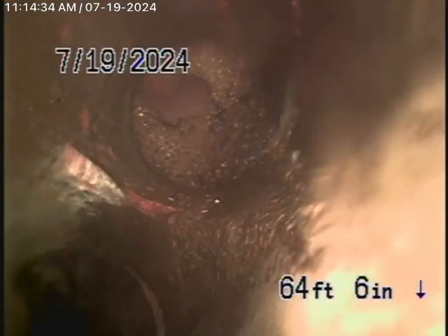Running the camera upstream, we've determined it goes all the way through to the next-door property — we're in at 64 feet, which takes us all the way there. Obviously these three houses share a common sewer line. We're bringing the camera back; the end of the line is about 62 feet away, probably on the next-door property. There are little bits of roots coming into the pipe, but the camera went through pretty easily.